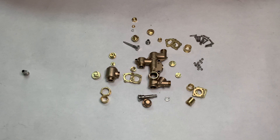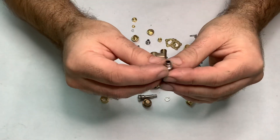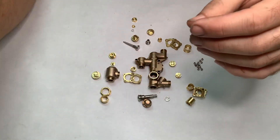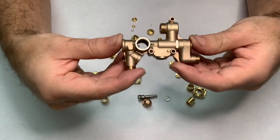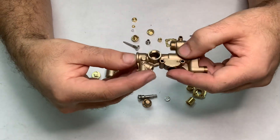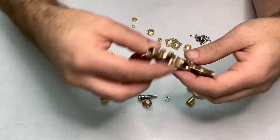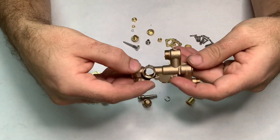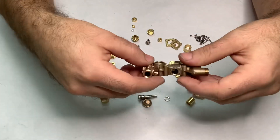The first step's already been completed, which was to press in the combining cone. I did these all at once and made a special mandrel because I didn't want to risk compressing the body. There are two distances in here that are very critically machined to a precise distance, and if they got crushed even by a couple thousandths it would make a difference on the injector's performance.